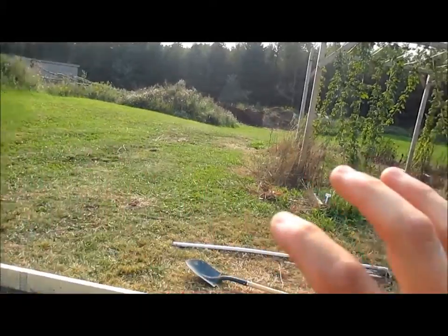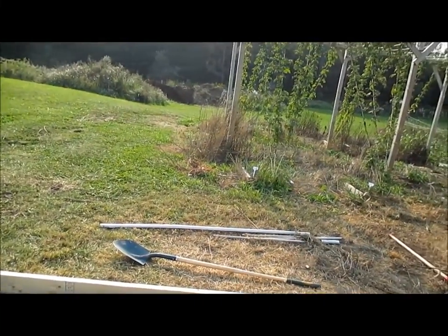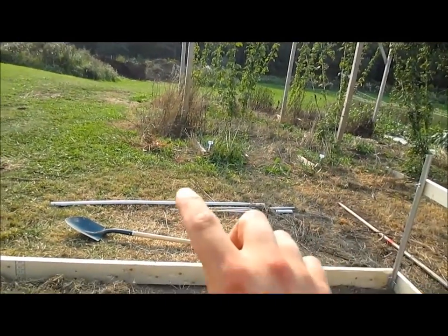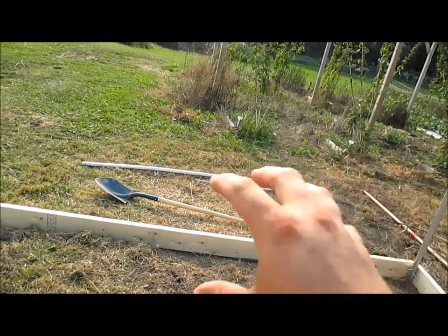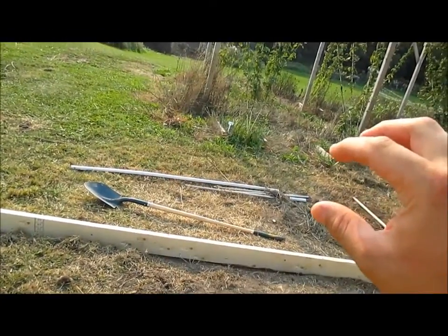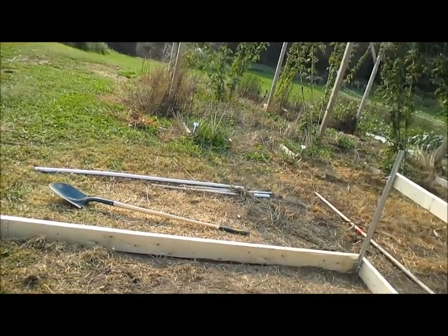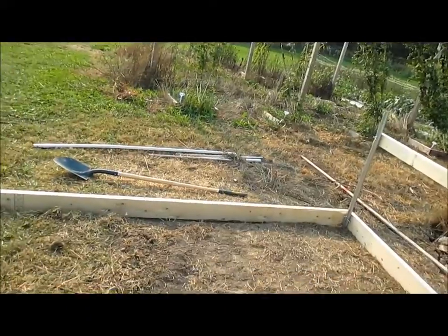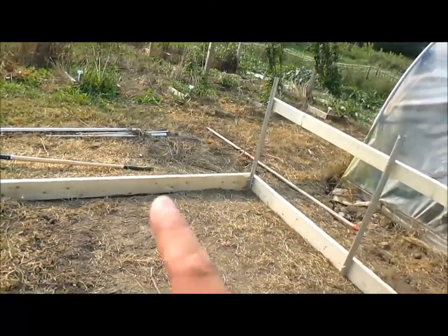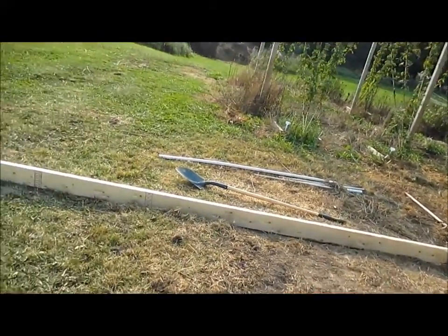All I have to do is take my sheet of plywood, lay it flat on some sawhorses, cut the window out while it's laying there, and then just attach it with a hinge and put it right up. It's not like I'm having to cut and measure for a new window — when I cut the hole, just use the same piece. Once it's up, you'll get a better indication.